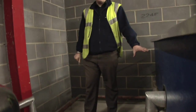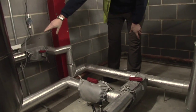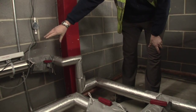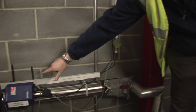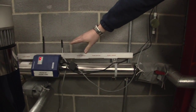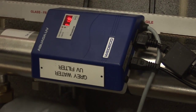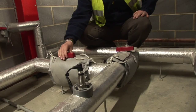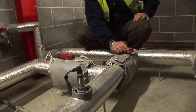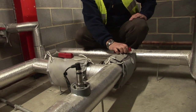The internal cold water service day tank outlet is via an ultraviolet filter to remove any bacteria within the system. It's important that the monitoring device is regularly checked — it will count down the year's use for the lamp, and once the year's use is down, you must replace the lamp. To ensure continual operation, the ultraviolet filtration is fitted with inlet and outlet isolating valves and a bypass. To replace the filter, isolate the inlet and outlet and open the bypass, ensuring continual use within the building.